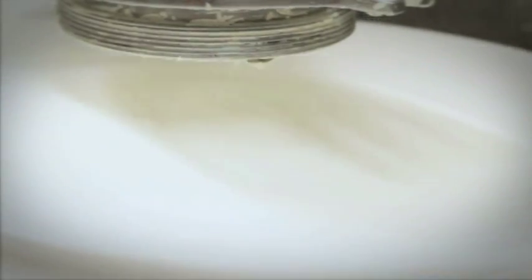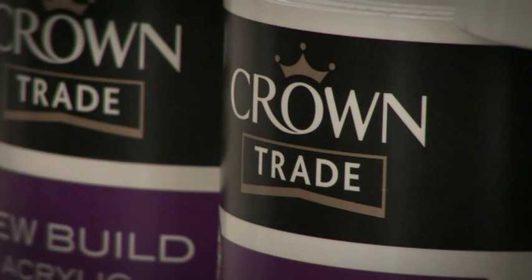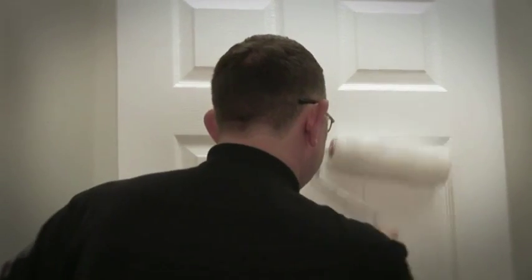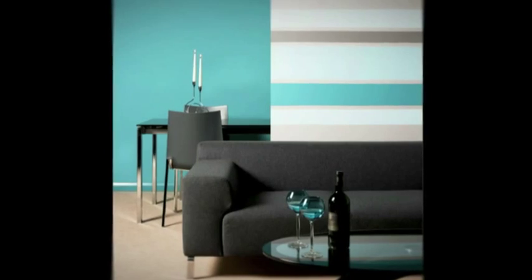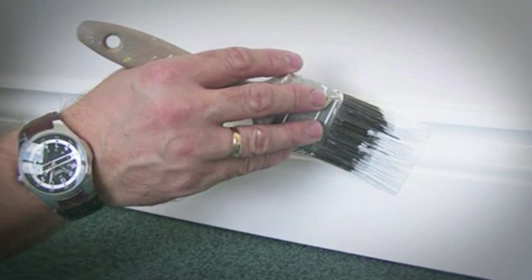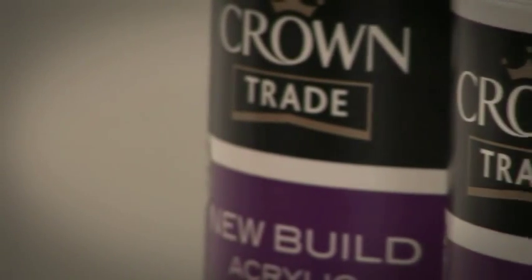Crown Trade has launched its acrylic offer as a solution. As well as not yellowing, the acrylic products have other added benefits over traditional gloss paints. These products are safer and more pleasant to apply, having less unpleasant solvents. This also means they dry more rapidly and are usually able to be overcoated after only four hours. They also offer a better match to pre-finished doors in many new homes, both from a colour and sheen level point of view. The house purchaser benefits from having longer before they have to repaint their trim areas, as the acrylic products retain their just-painted appearance much longer than their solvent-based predecessors.